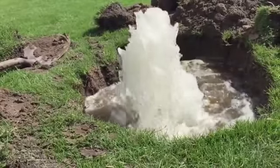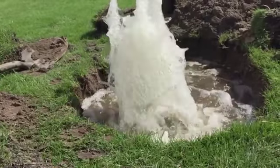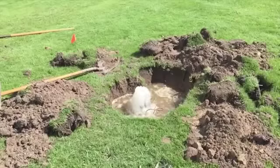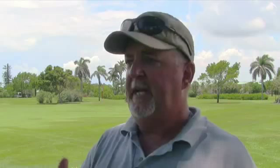Whether you have one, two, or three pumps, they all got to go down. All the water's got to run out of that area where you need to replace a sprinkler head. That's a lot of time lost, and the maintenance of starting and stopping the pumps every time you have a leak is very hard on the pump.